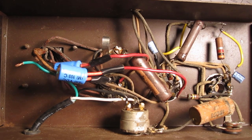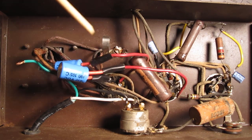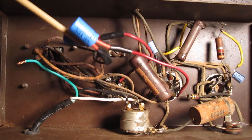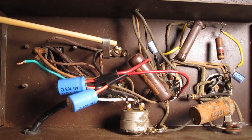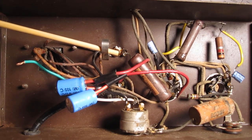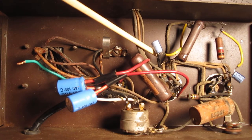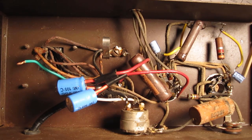Upon first inspection of this 1942 Master Tone, we've obviously had somebody in here before trying to replace some components. These are the electrolytic capacitors that are in the power section — they're just kind of floating around in here. The original one was a can cap that was in this frame right here, but that's been cut out and it's not being used. Actually, all the electrolytics have been replaced — this one here and this one that's in the input.